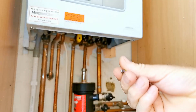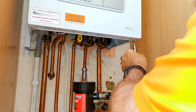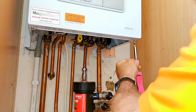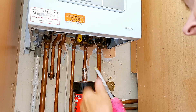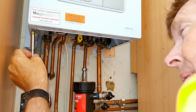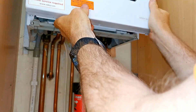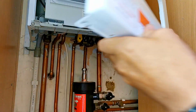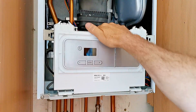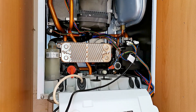Now I'm going to remove the front cover on the boiler - I need that little star piece, and sometimes a flat screwdriver will fit in there. A quick word of warning: when I remove this cover I'll have access to all the controls but also the gas valve and the combustion area, and removing the cover will affect how the boiler operates. So legally only gas registered engineers should be removing this cover to get access to the internal parts of the boiler.